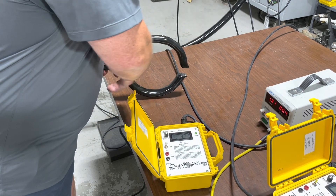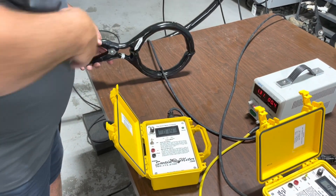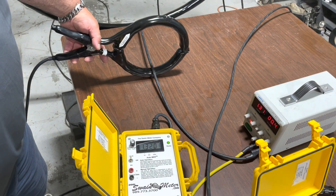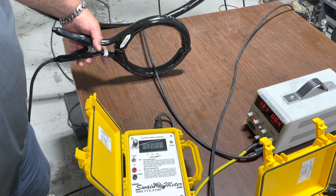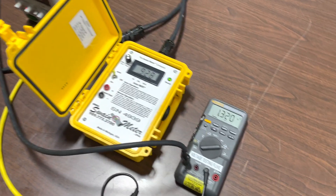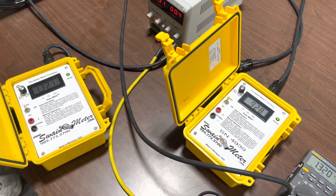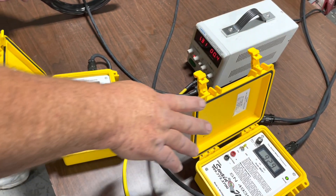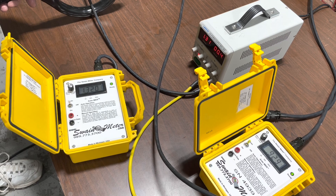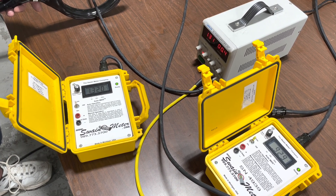So I can open up my meter here, put my 18 gauge cable in there, and close it once again. The 7 inch clip reads 1.321, very similar to the 1.32 of the inline Fluke meter. And on this Swain Meter, we are still tied to the 56 inch clamp with the 1.46 multiplier factor.